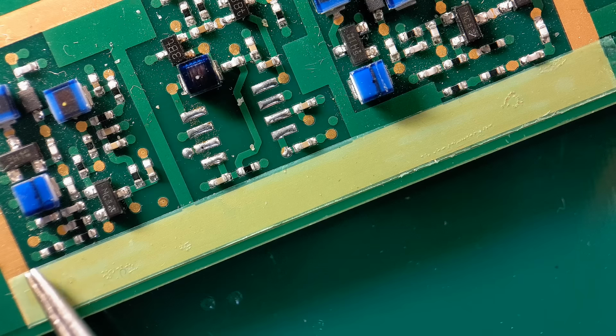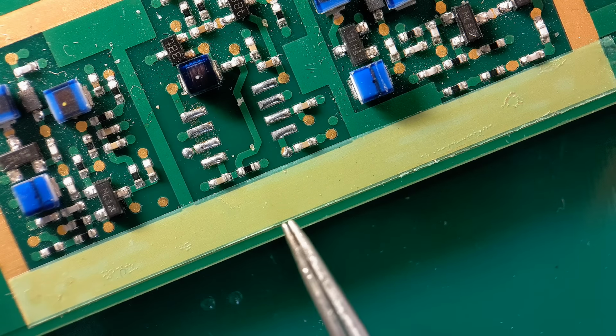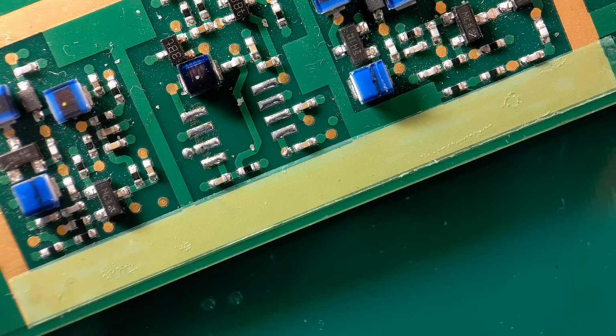So what I'm going to do quickly off camera, I'm just going to do the other 3 parts of this surround, and then we'll get some of this coated up, and we'll get the tape peeled off once it's dry and show the lovely finish. So yeah, it's a really good tape, especially for conformal coating. So like I say, I'll just quickly get the other sides taped up and then we'll get the coating on.